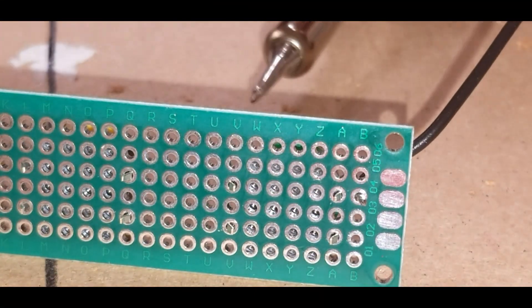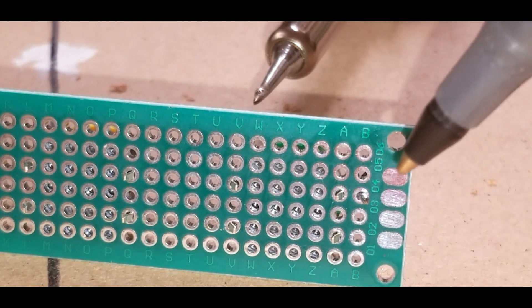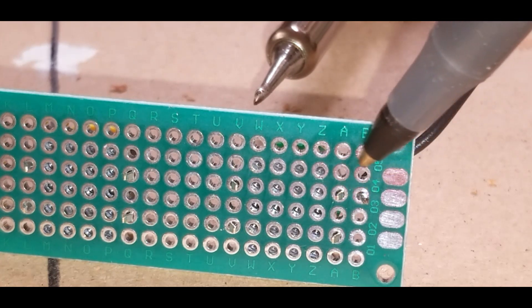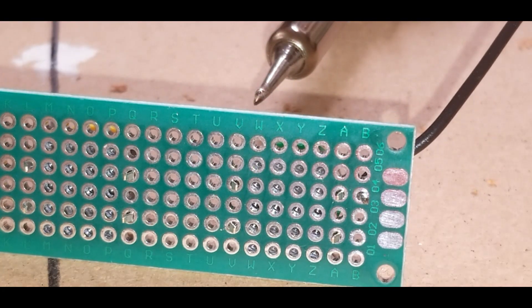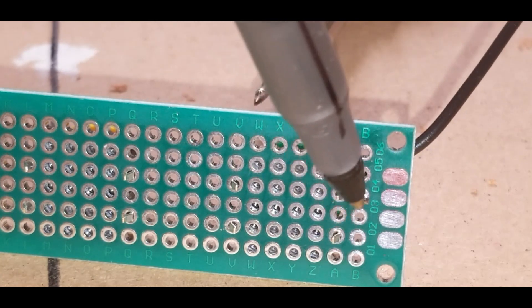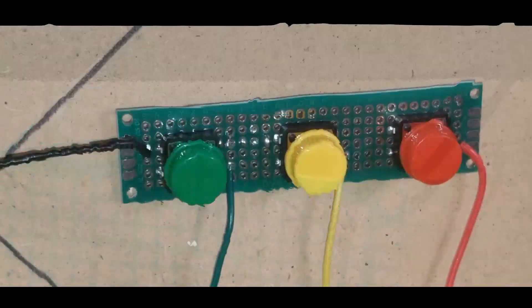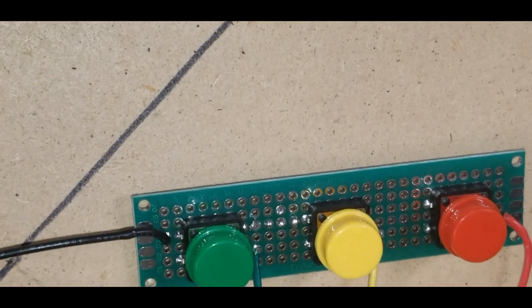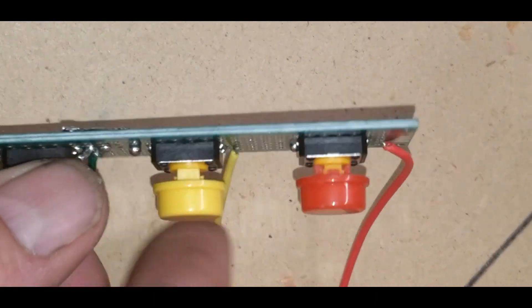I got some black wire here, tinned it on the end with solder, and stuck it through that hole. I'm just gonna make a bridge between those two with some solder, then jump all the way across to connect all the common grounds for the buttons. On the other side I'll do leads back to the Arduino board to the appropriate pins. The button module is done — ground wire over here and cord wires matching the buttons, soldered down.